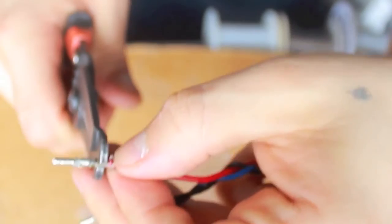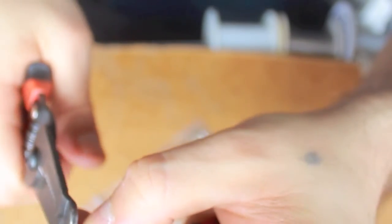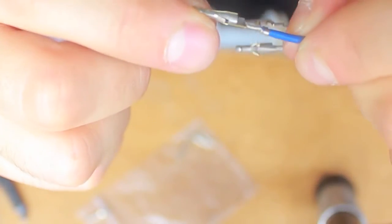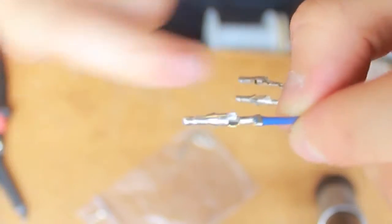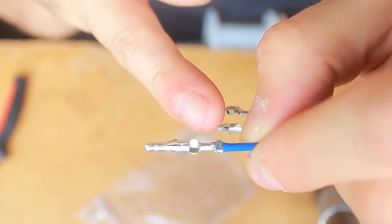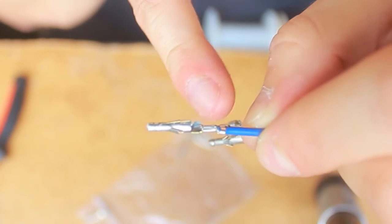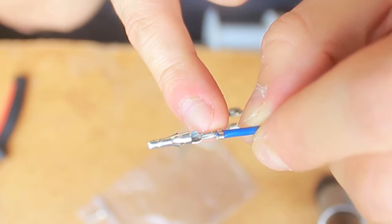So I'm going to tell you the real trick to this right now — keep your ears peeled for the golden nugget. If you just crimp them and put them in and try to use it — plug it in, plug it out — you're eventually going to pull a wire right out of this thing. It doesn't matter how hard you crimp it. What you've got to do is solder. There's an empty little trough left over with these wings, and those wings are what hold it in once it goes into the connector. So where it's crimped on the raw wire side, I solder it.